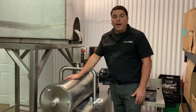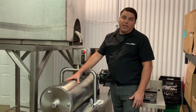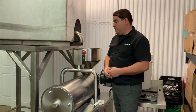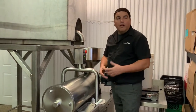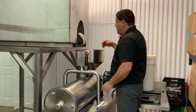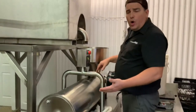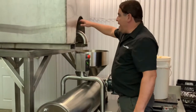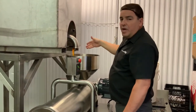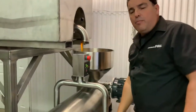In this case it makes 150 pounds of honey or 70 kilos, so we'll introduce seven kilos or 15 pounds of seed honey every time to accelerate the creaming process. Our cream machine runs very smoothly, doesn't make a lot of noise, and is very efficient and very fast.